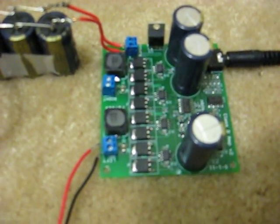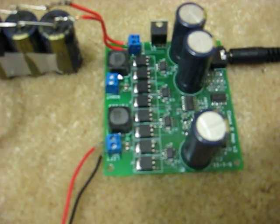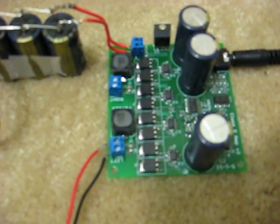You'll notice that there are four MOSFET drivers and eight MOSFETs for only two audio channels. This is because this is a bridged amplifier, which enables our peak voltage to the speaker to be our supply voltage, which means that the peak-to-peak voltage across the speaker can go as high as twice the supply voltage. So for the 30 volts this amplifier board is capable of, our speaker should be able to see approximately 50 watts peak power.